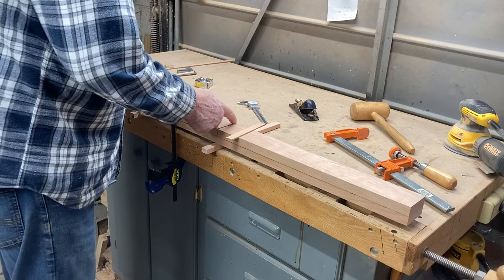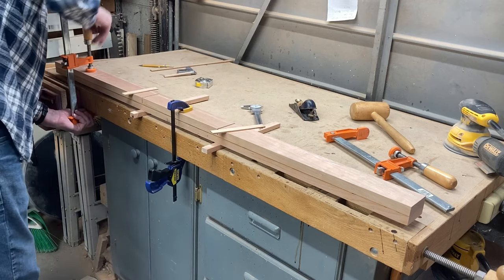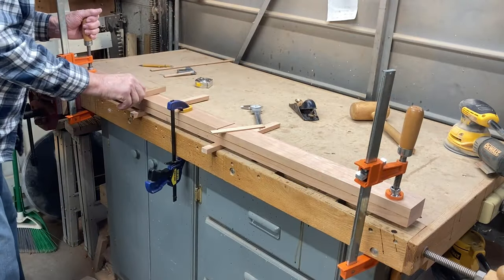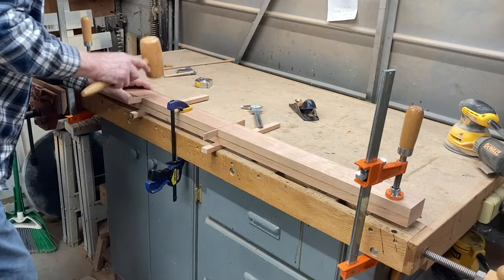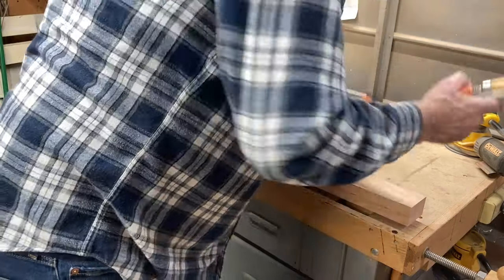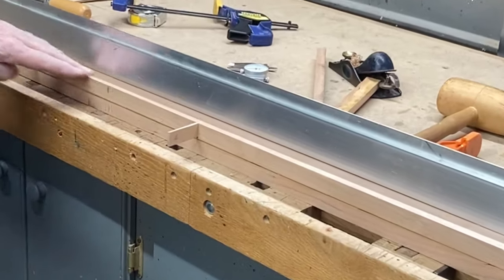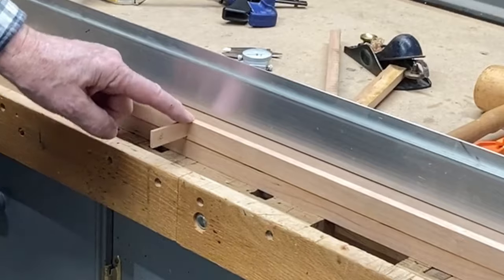I've cut the two grooves and I've got a couple boards right under those kerf cuts, so I'm just going to start clamping down on these ends to bend this board. I'll give it a little bit of a twist to see if anything fits. That one's starting to go — and that one went in. Didn't have to do much there. I'll release the clamps and see what we've got. I need a thicker one right there because it still bows down a little bit, so I need to put a thicker shim in.